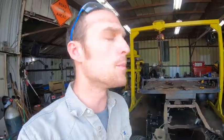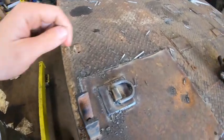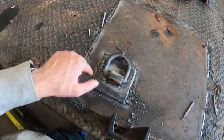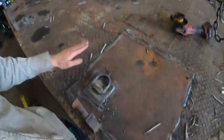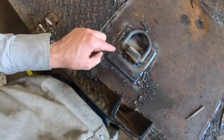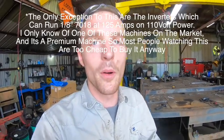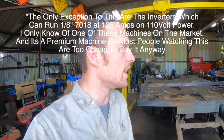On these, I actually just put one pass on the base plates because we're welding to eighth-inch thick material, and the cross-section of this is over an eighth of an inch with just one single pass of eighth-inch 7018. Normally if this was a three-eighths piece of machinery I would weld multiple passes around it, but since we're over an eighth of an inch it's more than sufficient. But where I'm going with that is: if you have a 110-volt welder, just don't do this. Find another machine, borrow one, or wait until you have one — they just don't have enough power to tie into material this thick.